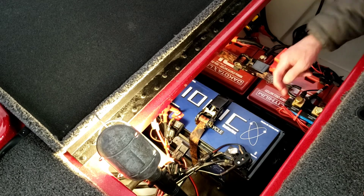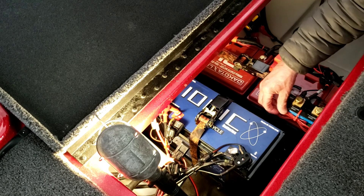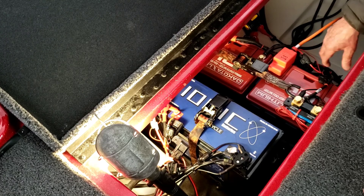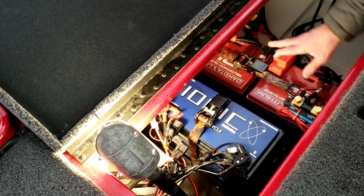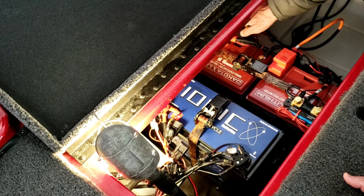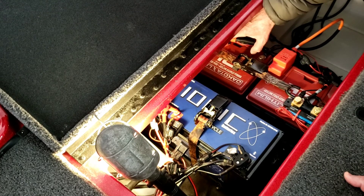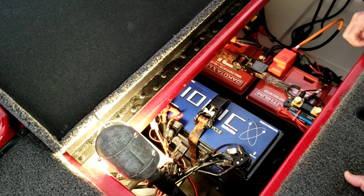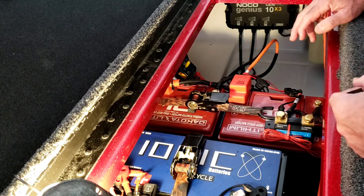On the shunt, these two wire connectors — I have one hooked up to monitor the whole 24-volt circuit, and the other goes directly to one battery to monitor its 12-volt reading as the midpoint voltage.